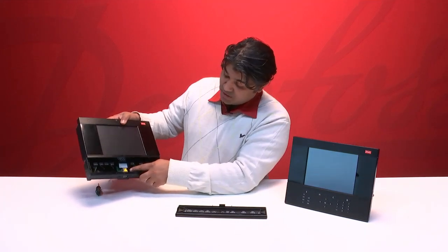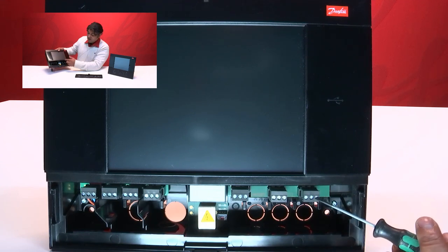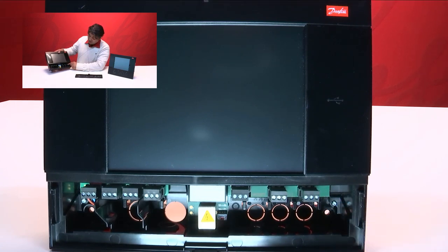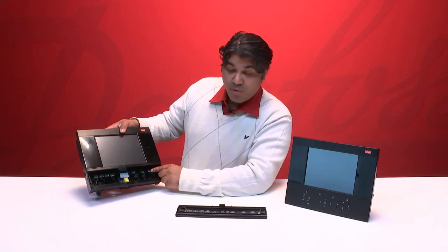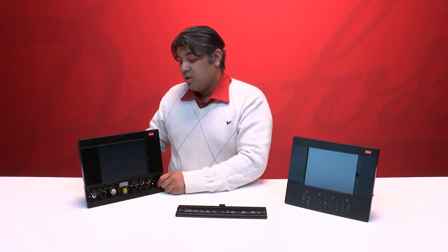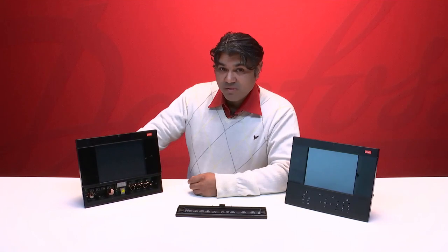We have the address switch, a Modbus, and another Modbus which is not in use right now but is there prepared for future use. And then we have in this version a LonWorks bus as well. This version is a Lon RS485. It is also possible to order a Lon TP78 unit as well. Then the connection will of course match the TP78 interface.